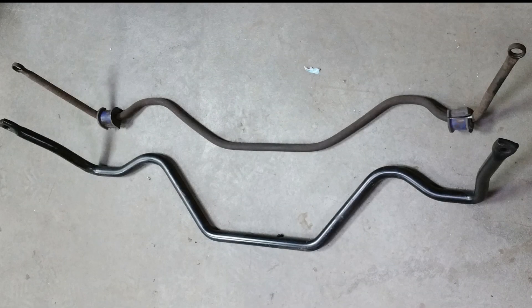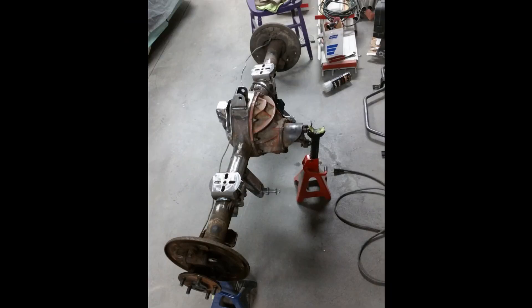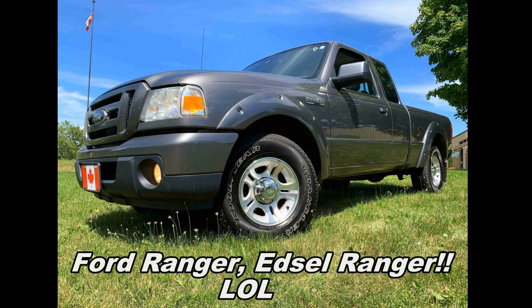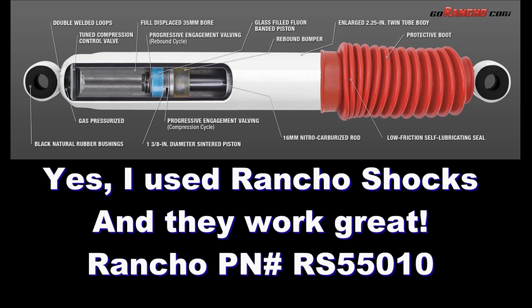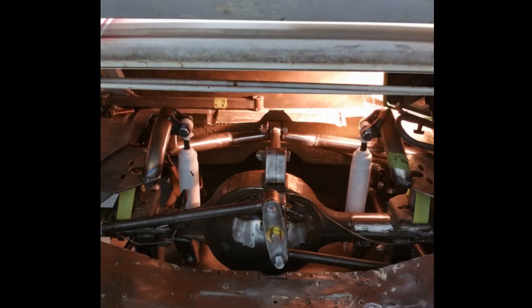To assemble, I tack welded the pieces cut by Welder Series and checked all my measurements for alignment. The car still needed a sway bar to complement the inch-and-a-quarter custom-made sway bar I put in the front. Due to space constraints I had to unconventionally mount the shocks, so I had to build the shock mounts integrated into the sway bar mounts myself. The Edsel is a similar size and weight to a Ford Ranger, so I ordered shocks and a three-quarter-inch sway bar for a Ranger.